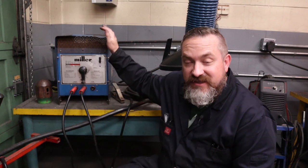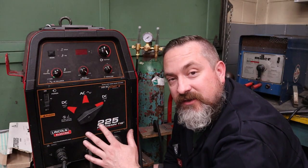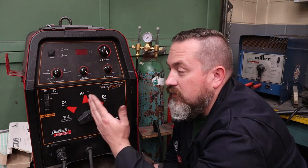The next factor is what machine you are using and what kind of polarity it is capable of. Some older machines can only put out AC, so in that case you need an electrode that will run with AC. If you've got a machine with all the different polarity settings, you can use electrodes with specific polarity requirements - DC positive for thick projects with great heat penetration, DC negative for thinner projects, AC for something in between, or for materials like aluminum or magnetized steel.